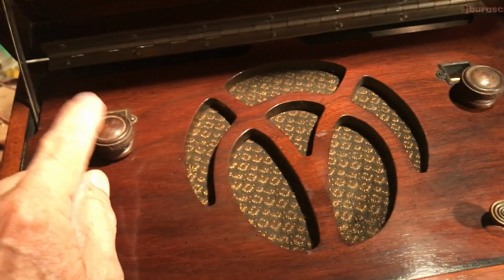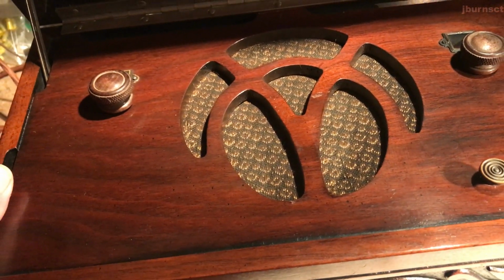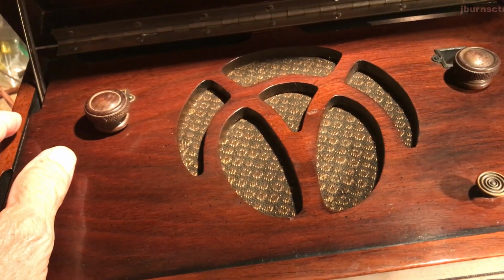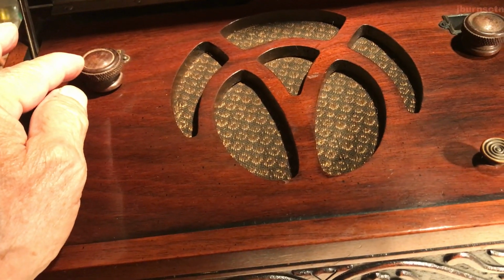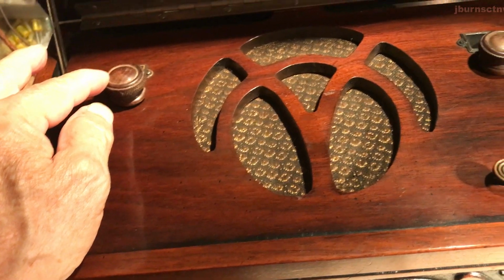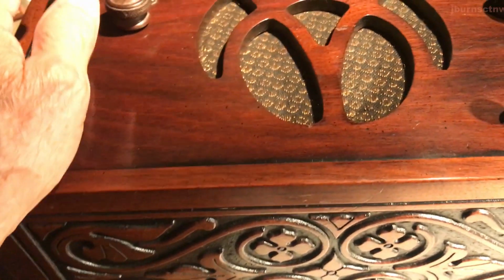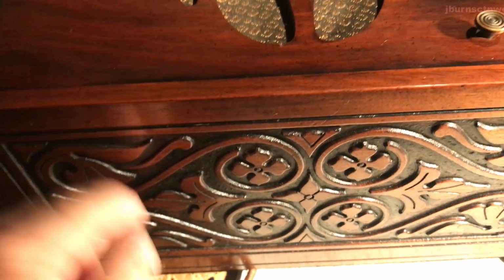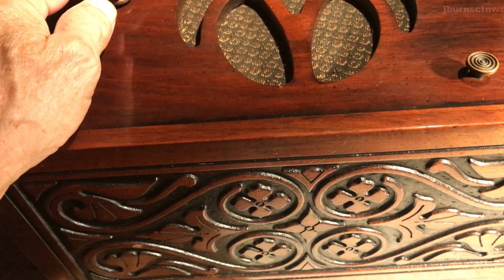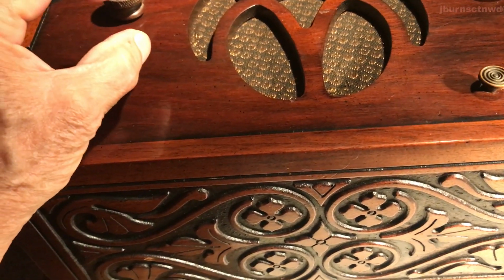I've got the volume up. It's on a long wire. It's pulling 670 milliamps. There is a 1 amp fuse in it. I checked it and seen that it was a 1 amp. I would rather have a 750 slow blow in it, but I don't have any 750 milliamp standard inch and a quarter fuse to put in the fuse holder. All my fuses are, I think, 22 millimeter. They're the short fuses.